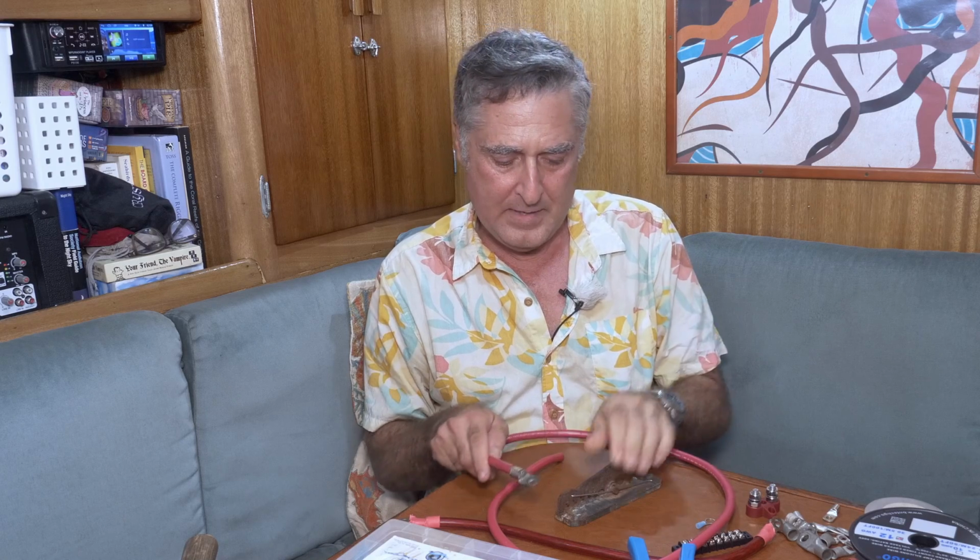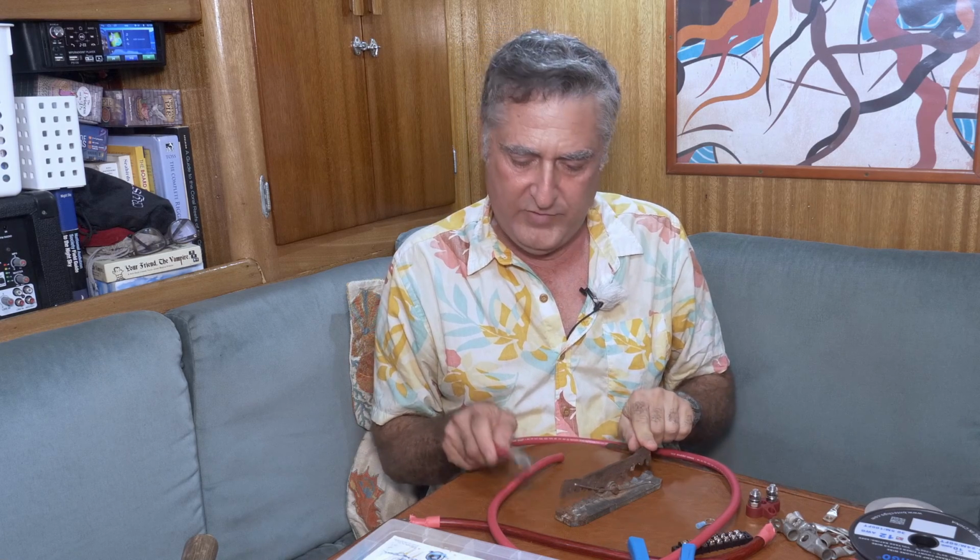And honestly, they're even smaller. What I like about this one is it works very well and it doesn't take up much room in my kit. All you do is you place the terminal on the wire, you place that in the appropriate slot, and you want to drive that little pin right down into the copper and it'll bring everything together. How do you drive that down? With a BFH. You give that a whack.